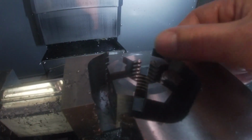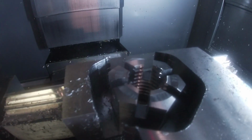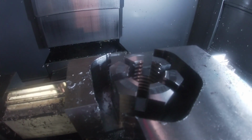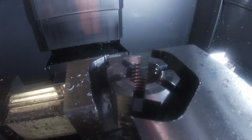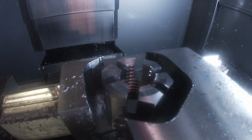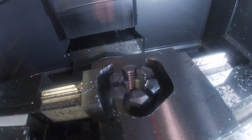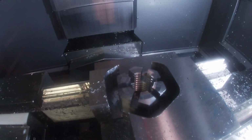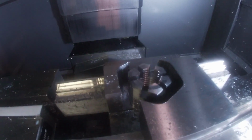This little flap here, I'll have to clean that up with a chamfering operation. So a 45 degree chamfer end mill will go and clean up that top edge, because the thread will go to an infinitely thin piece of sheet metal, basically, which is that guy right there. So let's get the cut off piston rod that Keith pulled out of the steam engine, and we'll see what our fit looks like.